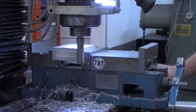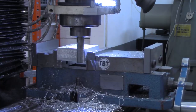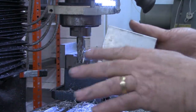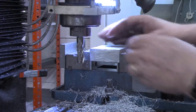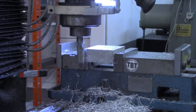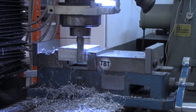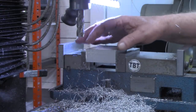All right, that was conventional milling. I'm going to move over about three or four thousandths and climb mill just to give us a good clean finish on that end. I'll deburr those edges right quick. I just wanted to clean some edges there to make it seat in the vise good. Now just a climb mill pass to clean that up. I'm going to deburr this piece all the way around, get it cleaned up good, then we'll set up to drill and tap.